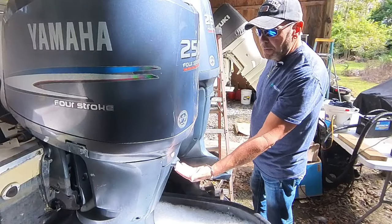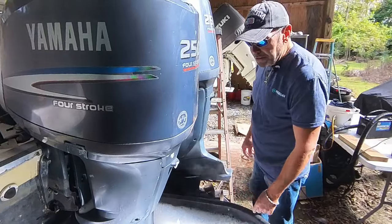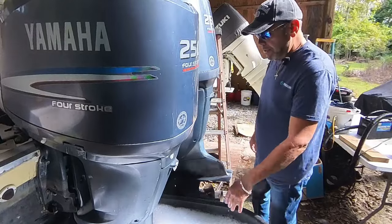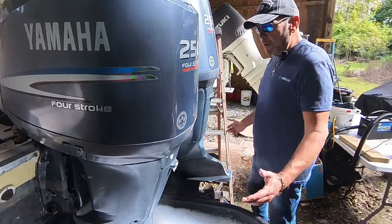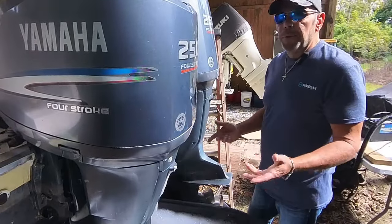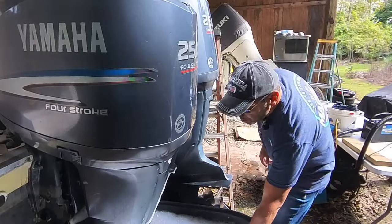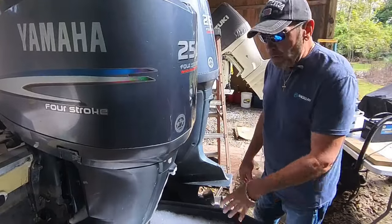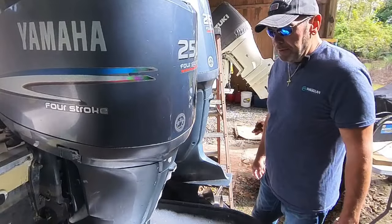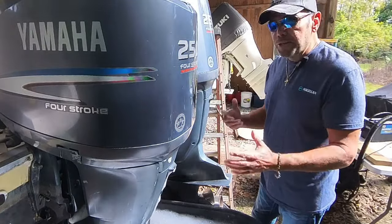That's coming out the powerhead exhaust — a lot of soap. This is so good for these outboards. It's a good hack — it really is. It's a good way to clean out your cooling passages, your water pump pick-up tube, from the water pump to the powerhead. It works on any outboard. We've done the hot soak — that's shutting the motor off for 10 minutes — and now we're going to let this run for another 10. The water's about 80-85 degrees, starting to warm up.